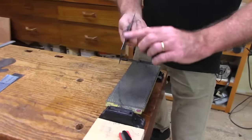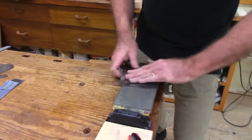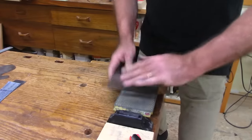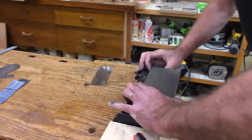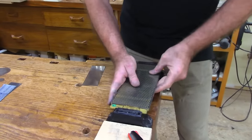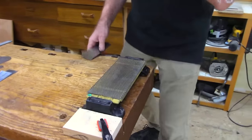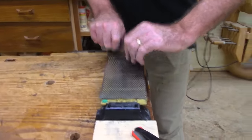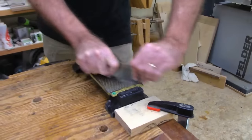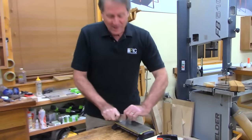We've got that nice edge flat. Now I'm going to go one more time flat like this. You could push the burr over right now but let's go just a touch finer and it'll give a better quality burr. So we'll get on this side — 25 micron equals 730 grit, almost 800 grit. And how about the nine micron — the green side is 9 micron, 2150 grit, excellent.